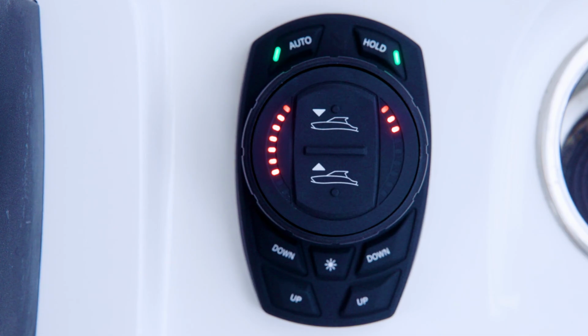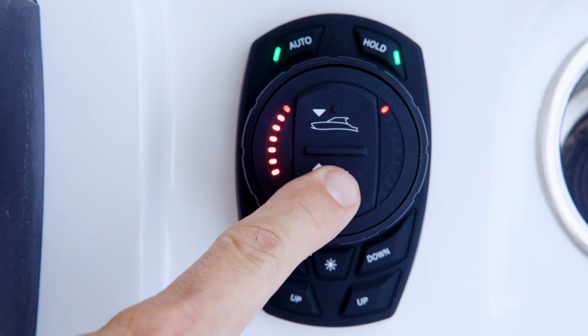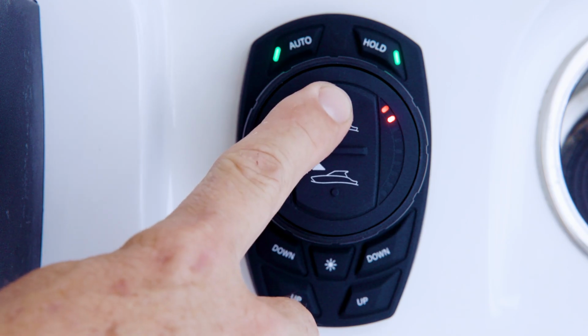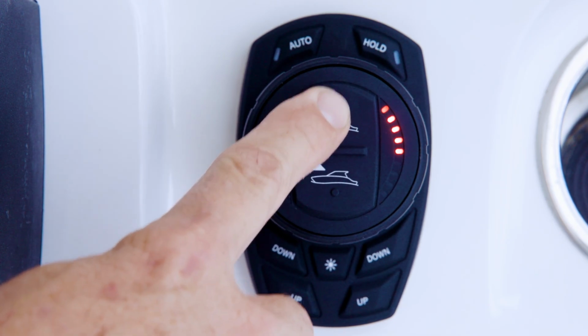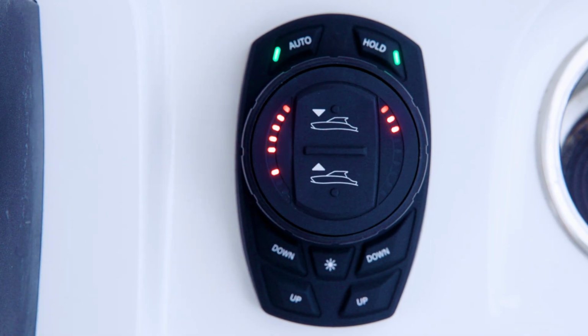There are 5 speed options as indicated by the LED indicators on the right-hand side of the dial face. In order, each LED corresponds to a greater system speed, beginning at 20% at a minimum and ending at 100% at a maximum. The controller aggression level can be adjusted by using the all up and all down buttons on the dial face.